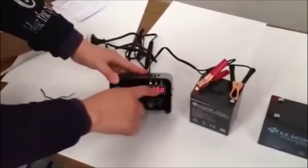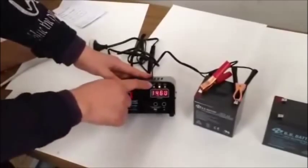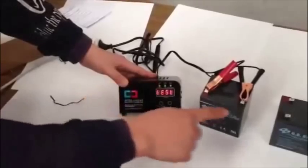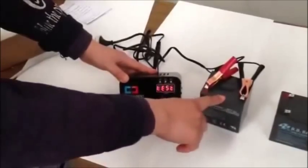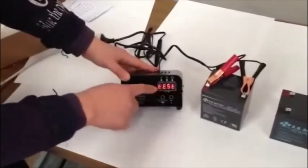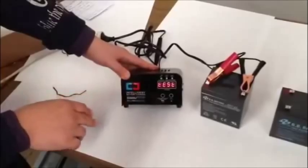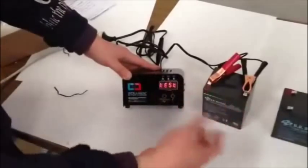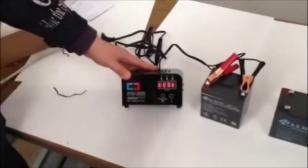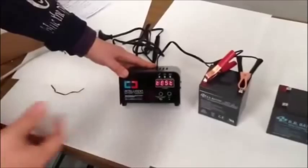This is showing the voltage charging using 2A. This one is showing charging, and this one is desulfating. Because this battery is already fully charged, they straight away go to test mode. They will do the final test, then go to trickle charging, then recovery and some other work. They will use about 1 hour to do the final charging and desulfating.